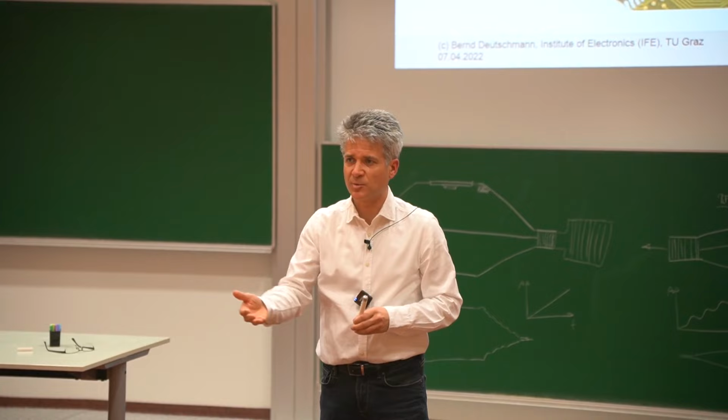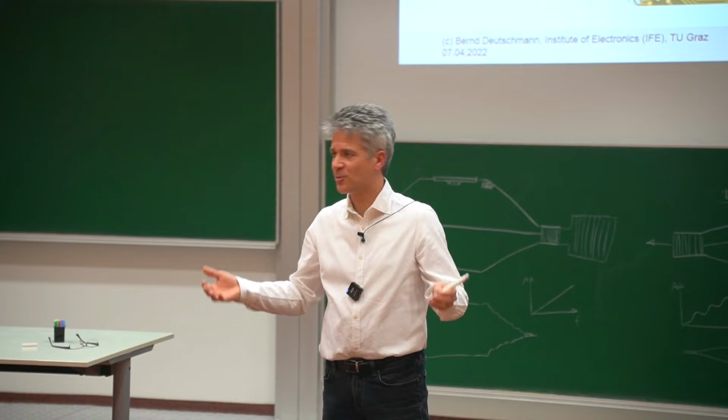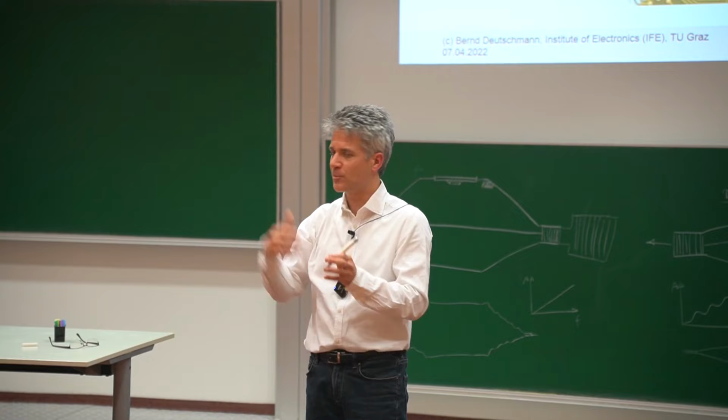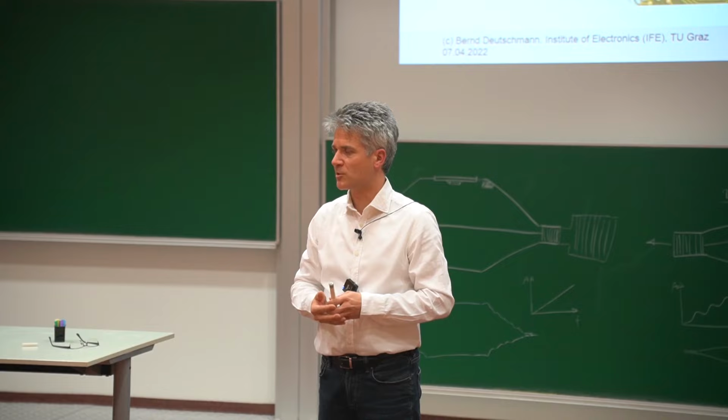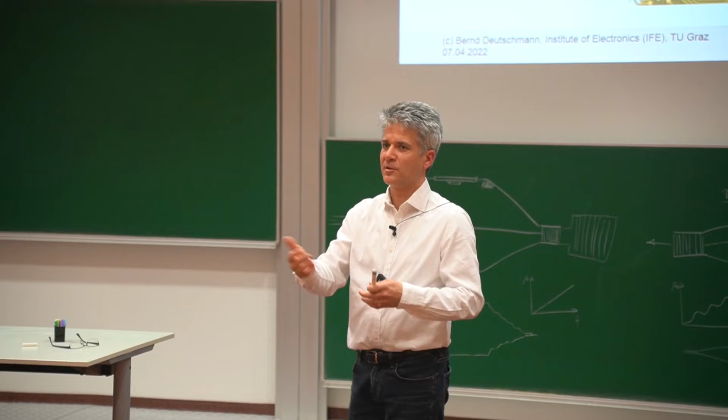suppose you have a microcontroller. The microcontroller is in sleep mode 99% of the time and just wakes up when something is happening. Then it captures some information, provides this information and falls back into sleep mode. And if most of the time the microcontroller is in sleep mode and you are scanning, you will not measure that much electromagnetic emission. So therefore, you have to wait at each position at least 3 times as long as the microcontroller takes to get out of sleep mode and get back into sleep mode again.